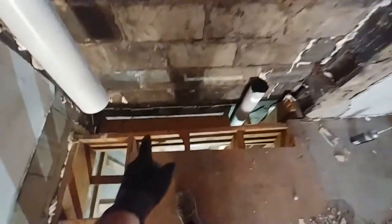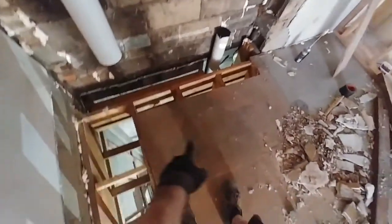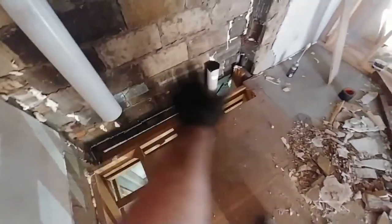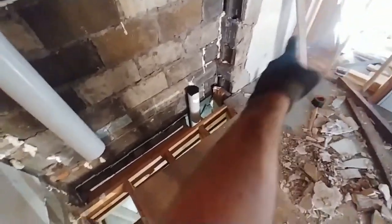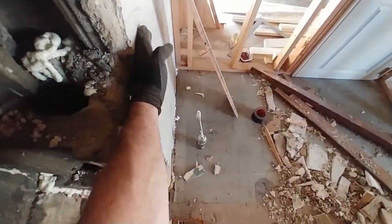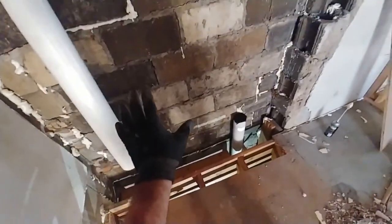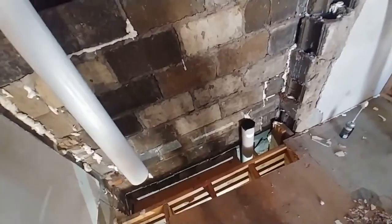foam. So then I intend to build a little bit more of a floor box out onto here that's at the same elevation as this floor box, and then put the same plywood over in there and completely cover it, fire blocking it out, because fire shouldn't be able to burn up through there that easily. And then we can frame a wall on it that comes in tight to this, whereas the one he had here left a big gap behind it. So that'll be in here. And then you will have a big airspace beyond it. And he does want to put in built-in cupboards that are out in that space. And that's fine. But you still have to have all of this here.